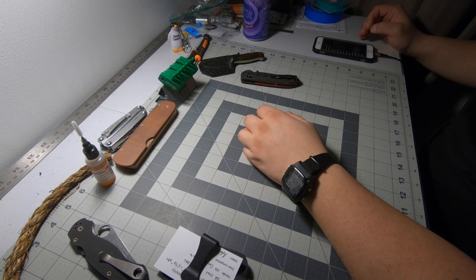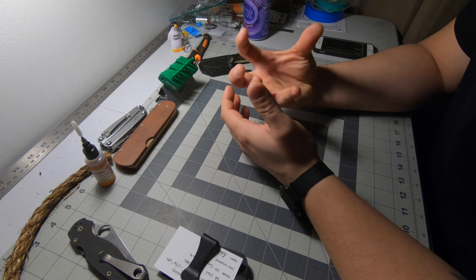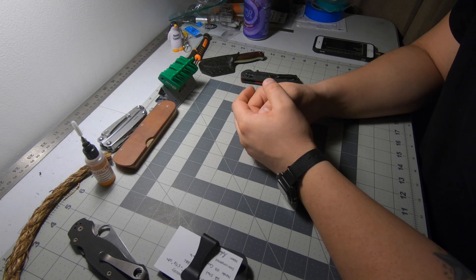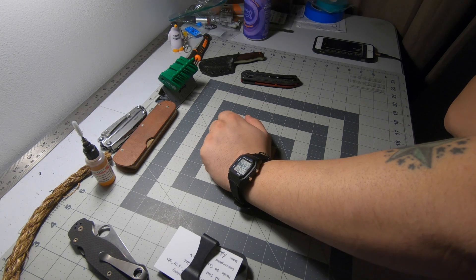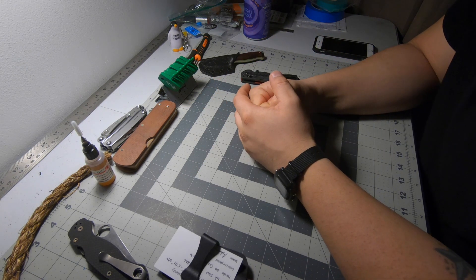Looking at the composition of A2, it's air hardening because it has chromium in it. Chromium makes steel corrosion resistant by forming a chromium oxide layer around the steel, and it's also a carbide former that creates fairly hard carbides. A2 has close to five percent or a little more chromium, so it's not stainless, but the chromium does help. It's a very good steel.